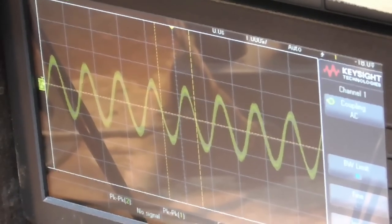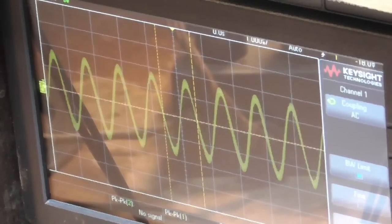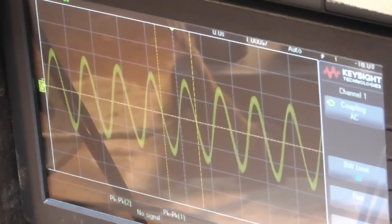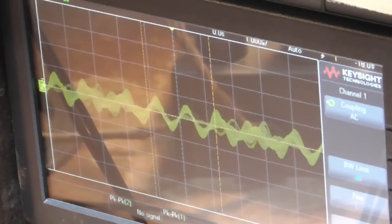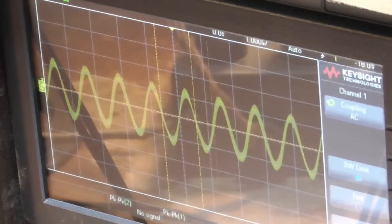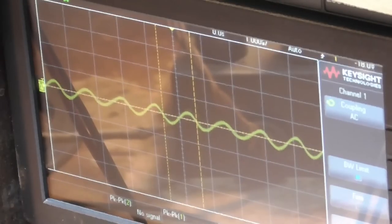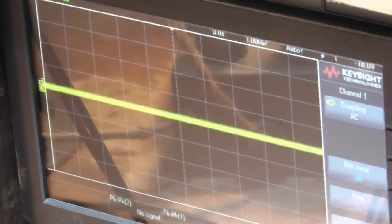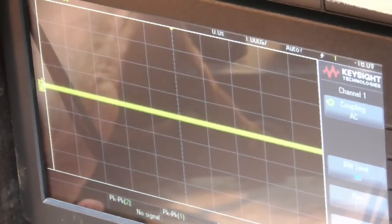Okay, I've got it set to 1 megahertz, so when I tune the tuning condenser, okay, there we are. We're peaking at 1 megahertz, and if I look on the dial, we're reading about 900. Now, the reason it's low is either it's not tuned correctly or the loading of the scope probe has pulled it down a little bit. Okay, I'm not worrying about that right now. The main thing is that from the antenna coil to the input of the converter, we have the thing properly connected. Okay, if I put the tuning condenser all the way in, completely meshed, 550, I'm going to tune the generator.